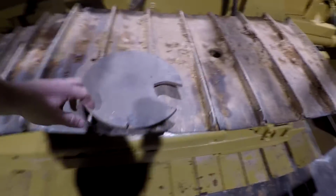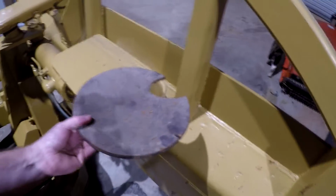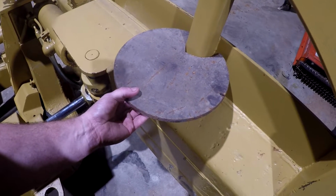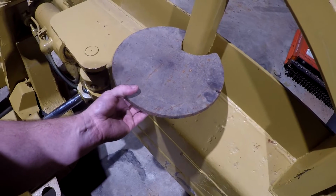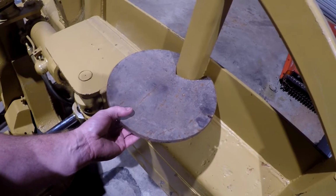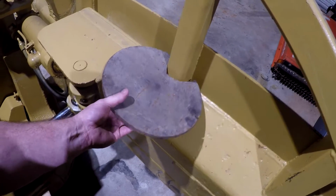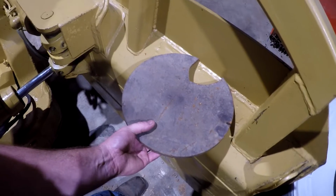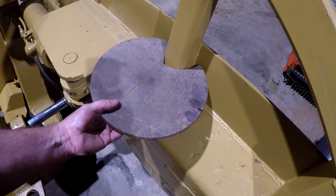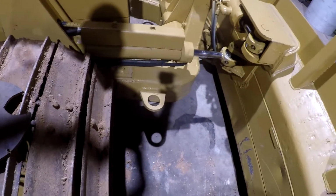And I've got some pieces of plate here, and my plan is to cut this into probably a square. That notch is where I cut something out of that already, but anyway, I'm going to make this a square, I think. I'll trim it down, whatever it takes to make this fit, and I think I'm going to put one on each side. I think this is a good location for it right here on each side of these bars, and I can weld around that, and that'll have some additional support to it and everything. I could also go down here, but then I'd have to put more of a mount in there to reinforce it. I'm thinking if I cut a notch in it like that, that I can put it around there on each side.